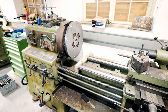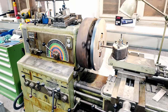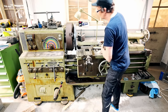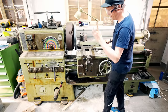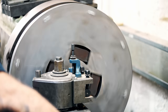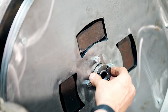First cut — yeah! The ID is actually done. We did some passes and the dimensions surprised us a little bit because the weld was almost gone, but I tried to tighten it and it fits perfectly. Now we can go to the OD. The carriage is locked, we have locked the two locking things.